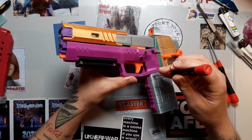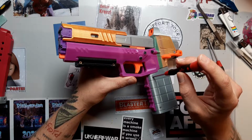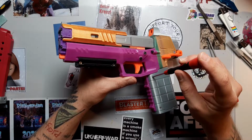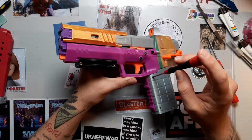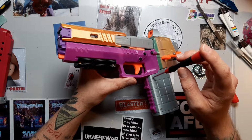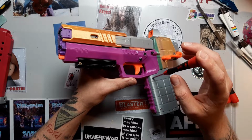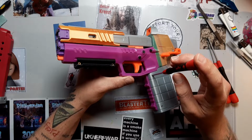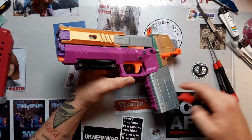What you're going to do is you put it in, and then you go the wrong way around, so turning to the left until you feel that the screw drops into that old thread. And now when you think that you got it, just slowly tighten it. You should have no force required to tighten this screw back in. Like you can see, I'm not using any force whatsoever, and it just goes in nice and easy, which means I am in the thread that's already there. If you need to use force, then you're actually cross-cutting your thread, and you should stop doing that immediately, because right now this is tight. Again, do not over tighten. This is just like so, and it's tight.